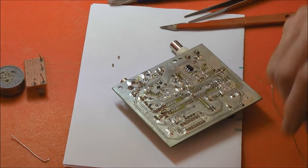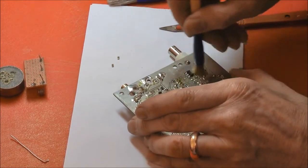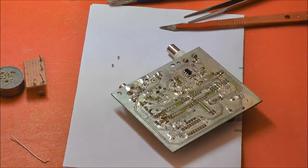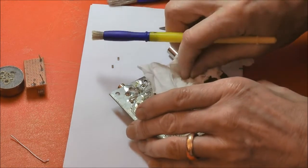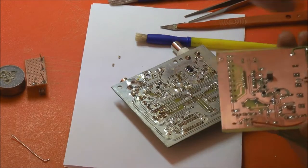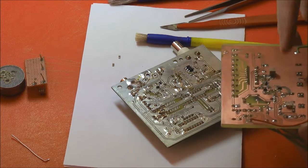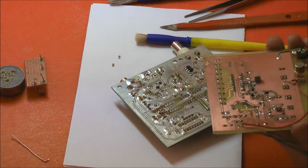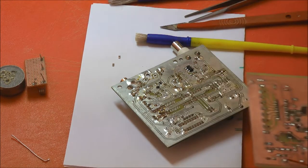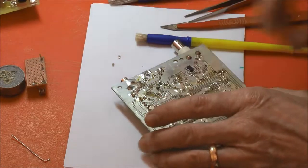So again, clean it off with all the isopropyl that's all over the table. When I was doing that circuit board there, I had fun because I couldn't get it under the microscope. My microscope I can get in about an inch or two, and it's only about 20 times magnification, which is roughly all you need. But I could see there, and there, but I couldn't see there. So I literally just had to tack it and then use a hand magnifying glass and see if it's in place, then do the others. So you're almost doing it by feel.